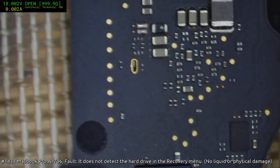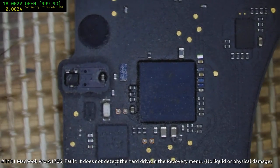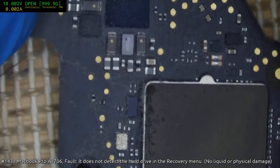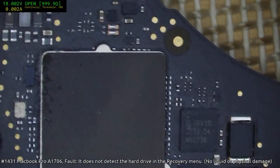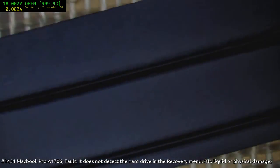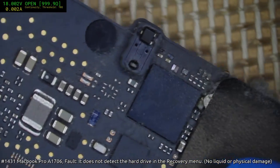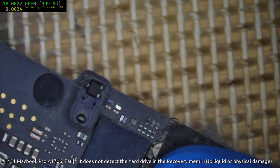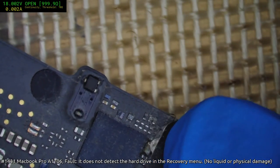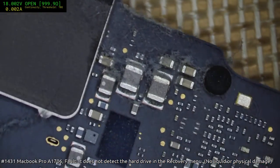There is enough dust here that... Okay, we've got underfilled CD3215s, no harm in that. I will say they don't really perturb me, the underfilled 3215s. I mean, they're a little bit of a nuisance. Okay, we've definitely got corrosion going on here. So, even if that's not playing a factor in the SSD, it can come about.